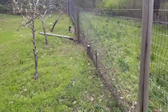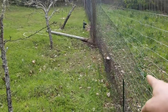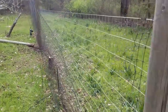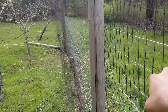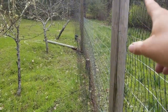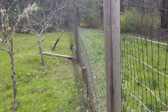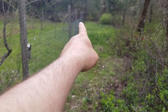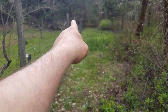There are places where the deer just rammed right into this post right here, and I'm going to try to pull the old fencing up and attach it to this. The welded wire doesn't come in 7 or 8 feet, so this is a 5-foot roll. I'm going to put a 5-foot section and then a 3-foot section from the top of the post down, letting it overlap onto the bottom one - about 7.5 feet total, close to 8. The first 5-foot roll is on and goes about 100 feet. I've got another 40 feet or so to go that way, then I turn the corner.